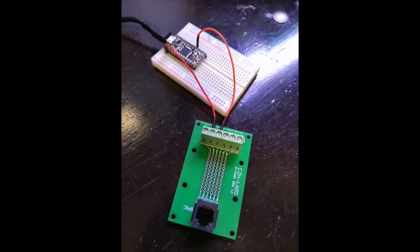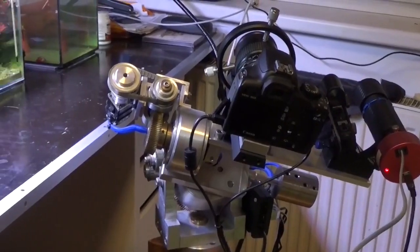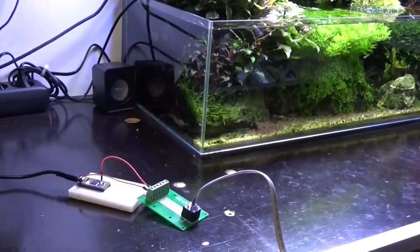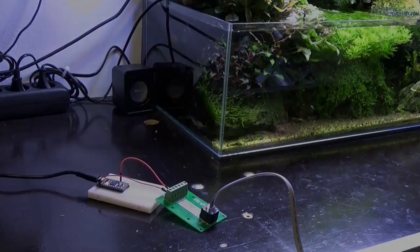Here's my experimental setup. I connected the 3.3 V to common — the 3.3 V are regulated and are the signal level of the microcontroller itself — and I connected the RA+ pin to a digital input of the microcontroller. As I'm away from my observatory, I've simply connected a little home-built mount with a QHY camera, and the ST4 cable goes into the ItsyBitsy M4.